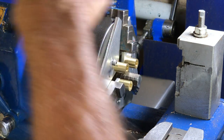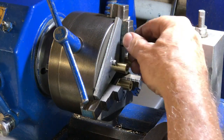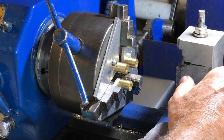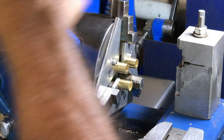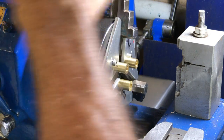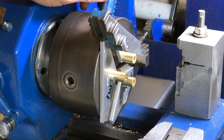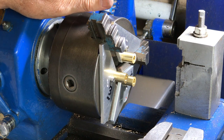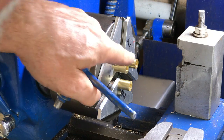Now, because of the extra five millimeters of the plate, these particular offsets are a little bit too high. I'm going to completely remove the jaws from the chuck because turning it with a jaw sitting in here without any tension on the jaws is considered dangerous - they can come flying out and hit you in the face or whatever body part is in line. So we remove number three first - it fell in the swarf, typical - then number two and number one.